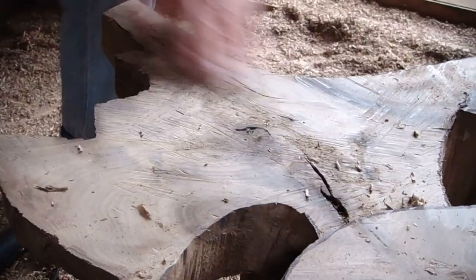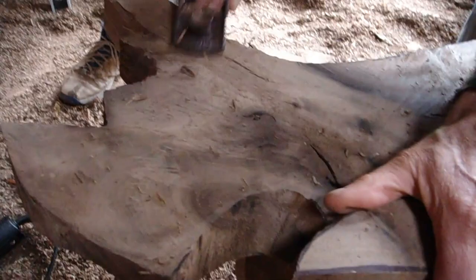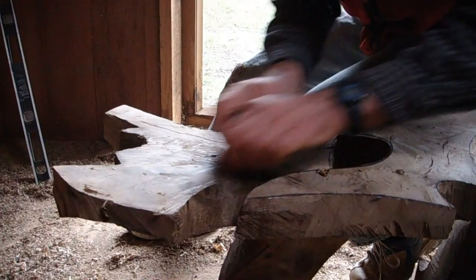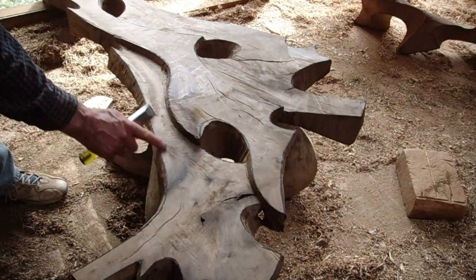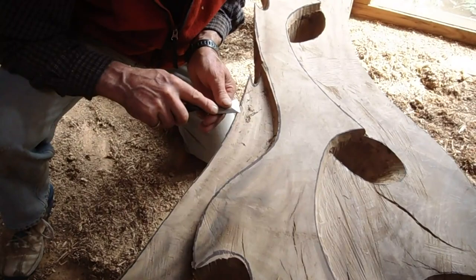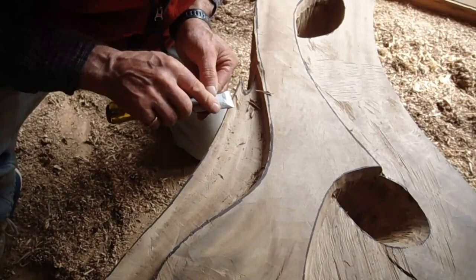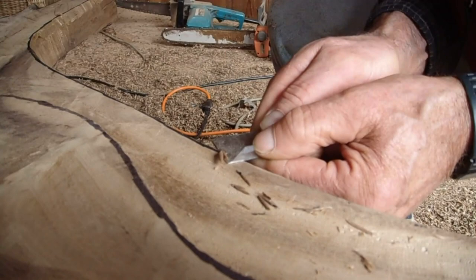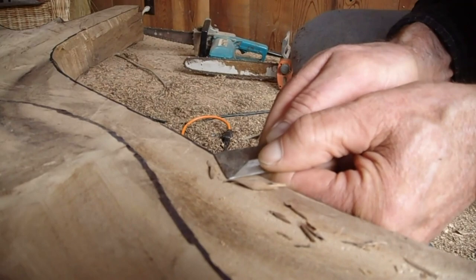I want to go like this here. I'm not concerned about the edges right now because I'll refine the lines on the edges after I clean it a little bit. That rough-textured area is very minimally lower, so I don't have to take it all the way down — it's within tolerance. I've gotten it close with the die grinder; now I'll take a chisel and refine this, take the pin mark off, and also refine the edge so it's a nice flat straight line. If you go in the wrong direction and don't cut the grain off properly, you can end up with a hole and then you've got a lot of work to fix it.